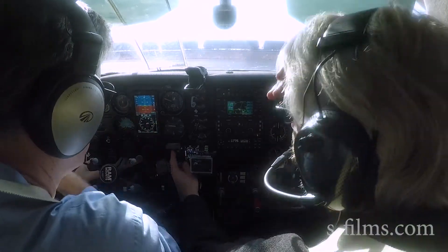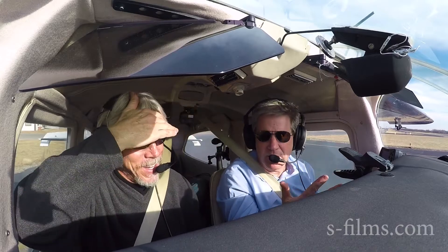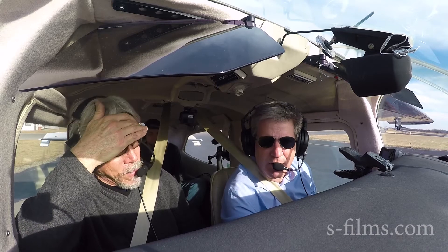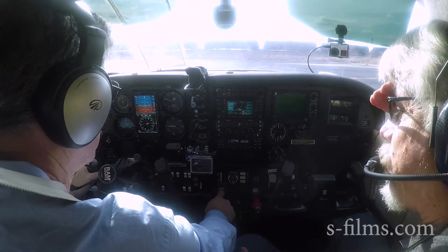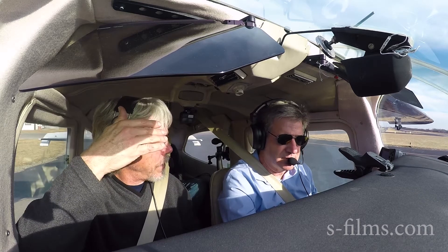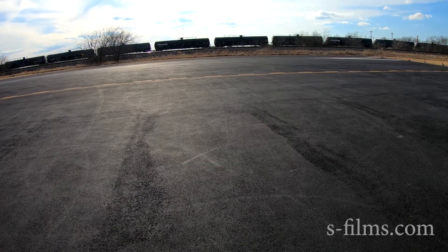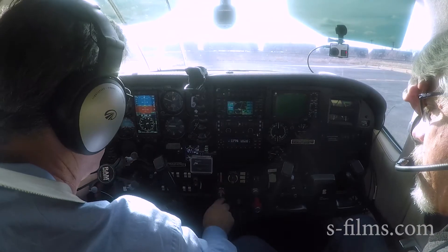Normally what you'd want to do is take it out of lean-fine at that point, then normalize. My suction looks good. I'm going to pull my prop back — it's just to grab and confirm it's working, that's all we need to do. You just don't want to pull it all the way down and load up your main bearings with cold oil. You're prop cycling to confirm it's operating. Now we've come out from our run-up and everything analog looks fine, and the JPI EDM looks good.